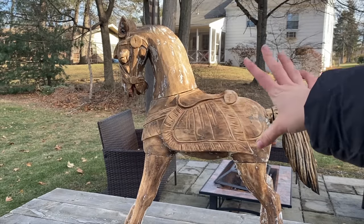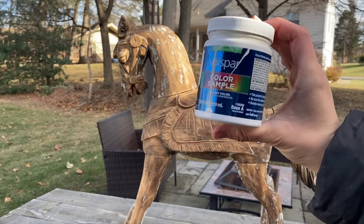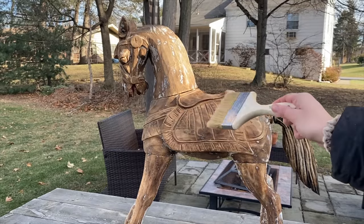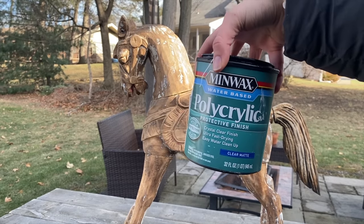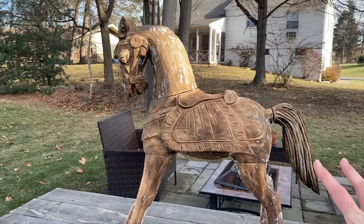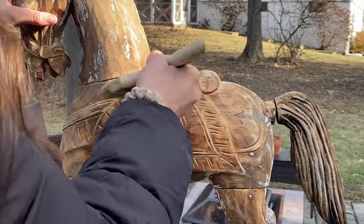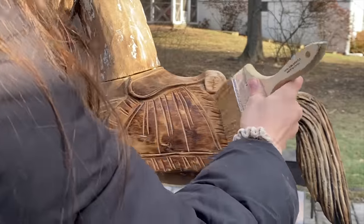Here is what we have so far — I really like it. I have two options: I have a little bit of Greek Villa paint and was thinking of going over it very lightly with a paintbrush just to add some more antiquing and rustic look, or I have some polycrylic which is a nice clear matte protective finish that will enhance the color a little bit — or I can just leave it. I think I might just put the clear finish on and start with that. I went in with a very thin layer of the polycrylic. Normally I'd do a bit heavier, but I liked how the wood looked naturally, so I just wanted to seal everything in without it being too shiny.